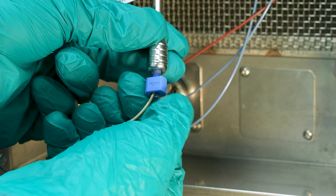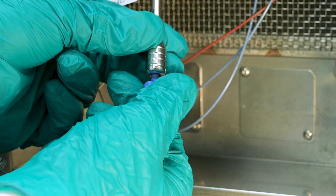If the leak is occurring at the inlet of the LC column, make sure the end fittings between the mobile phase tubing and the column are tightened and secure, taking care not to overtighten and damage the fitting.